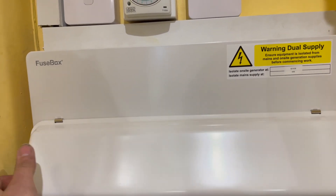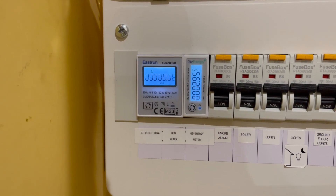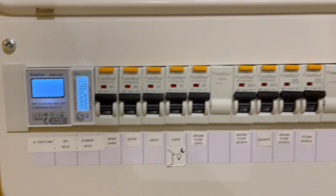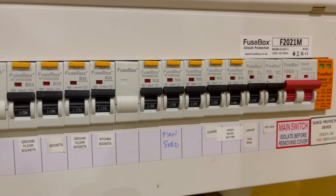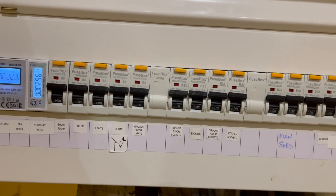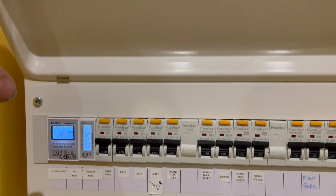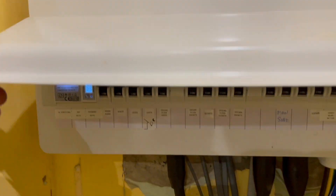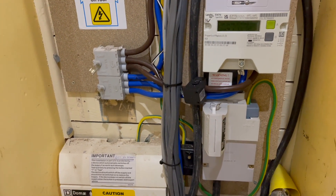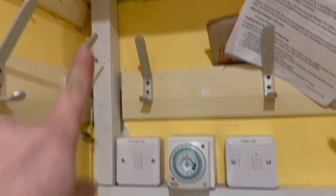As you can see you've got your meters just there — your bi-directional meter and your Givenergy meter, and your feed for the system. We've taken the supply for the meter from the lighting circuit. And then you've got your CT clamp down there which is monitoring what the customer is using, and the cabling goes straight up into the loft space.